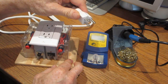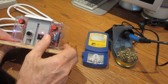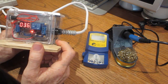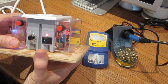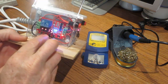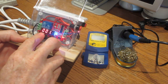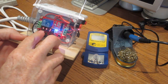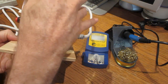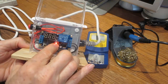The power cord will be plugged into a power strip. This is the main power switch with a standby LED. Both timer circuits are powered. These are the buttons for setting the cycle timer on and off times. The unit is set for function number 15: 5 seconds off and 1.7 seconds on. The delay timer has two buttons — the left button selects the digit and the right button increases the number by 1 each time it is pressed.